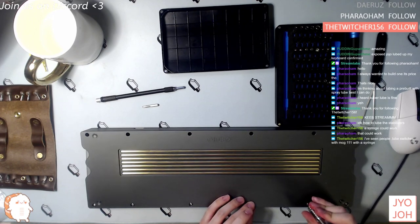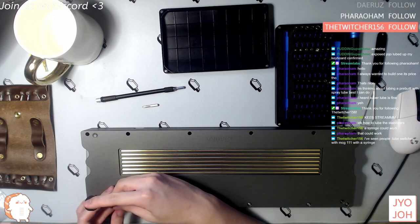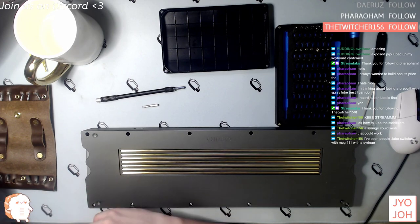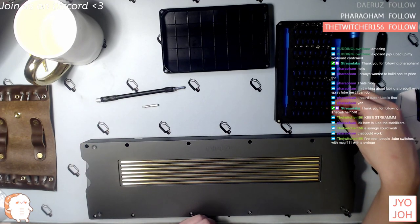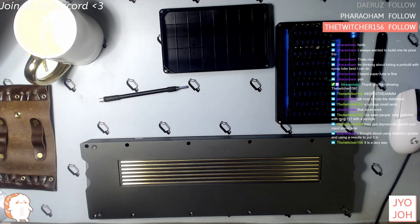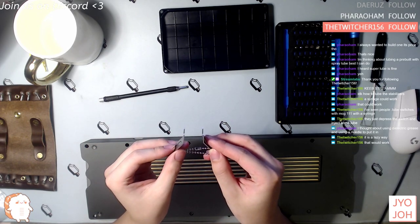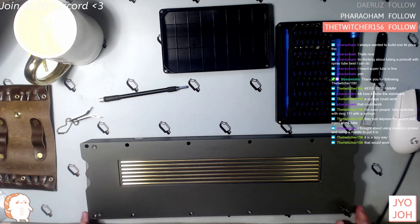You've seen people lube switches with a syringe, like switches already soldered onto a board. That would be crazy. A lot of plates support switch top opening, for which you would need a tool. If your plate supports switch top opening, if you have a tool like this, you could actually peel the top of the switch off and not have to desolder or anything.